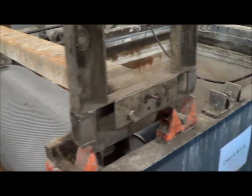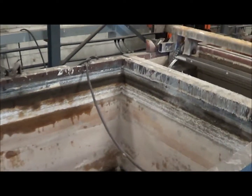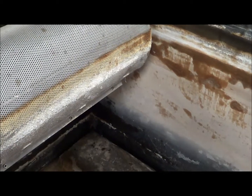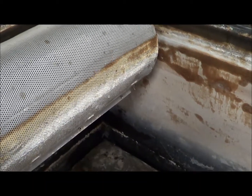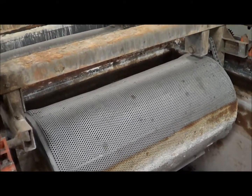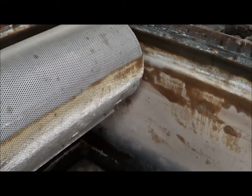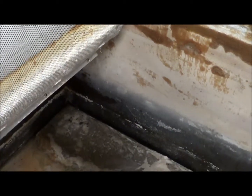There's a three-station soak cleaner. You'll notice that the tanks are fifty-six inches deep — that's why you can either do barrel or rack in this line. They're only doing barrel, but you could set up some rack carriers to do rack because of the extra depth in the tank.